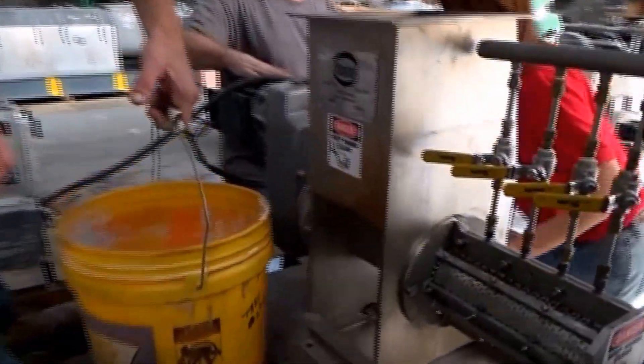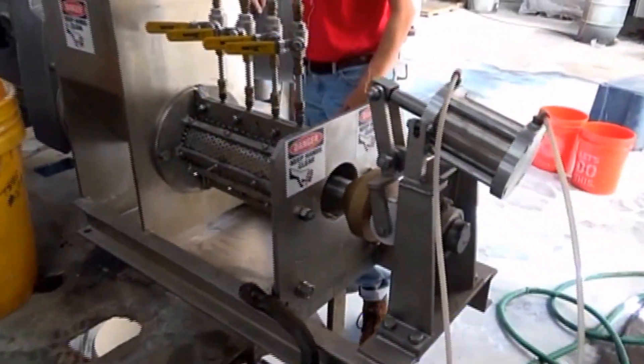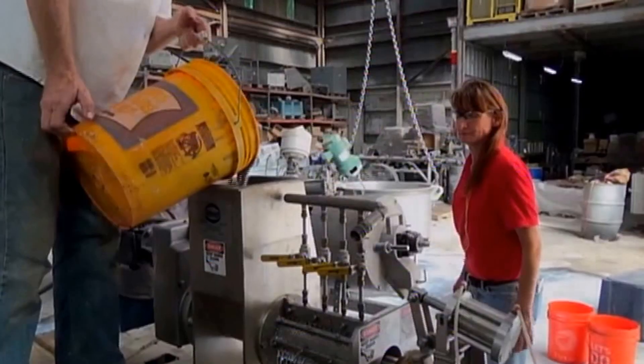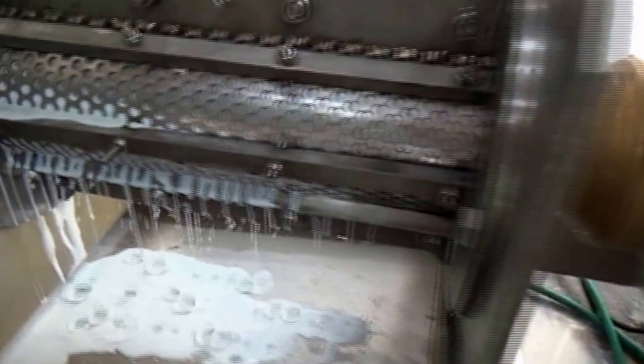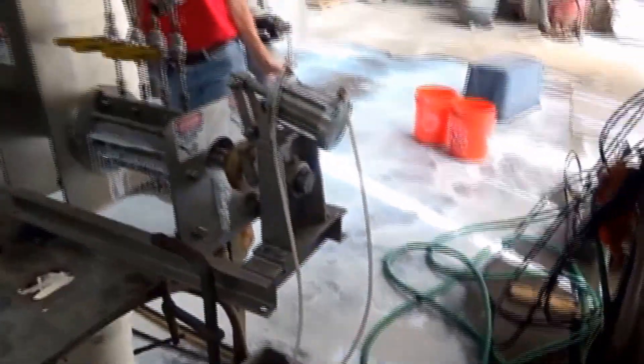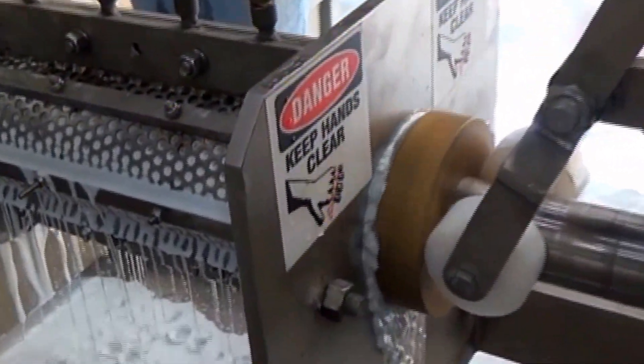Okay, we're getting ready to run this stuff. This time the screen we have in here has 023 — 23 thousandths of an inch, a little over half a millimeter — and you can see the perforated screen in there. We've got the cone open and we'll try pouring some in. We just started pouring in, got the screw set at 24 RPM. We're getting plugged already — I'm going to close this cone. You can see the cone close, and this cone does fit tighter than what we had last time.